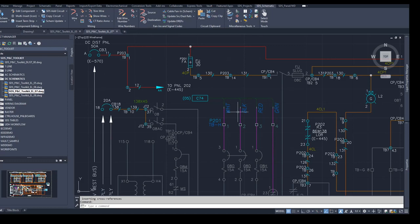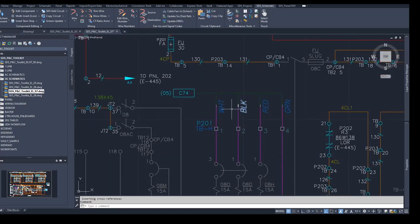linking the wires as continuous wires from one drawing to another. Now the tool places these in arbitrarily, basically just in sequence. So this is wire 1, 2, 3, and 4. And that's also the signal code values. So if you need to change those as you're going between the drawings, we have great tools available in the SDS toolkit, including this one like the swap signal reverse.